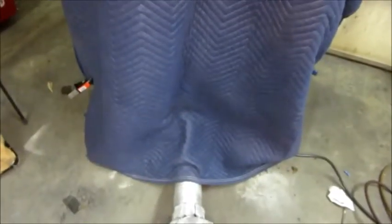The little heater's been blowing under the blanket to warm up the compressor, condenser coil, and all the lines. The vacuum pump's been running for about three hours, so I think we're good on moisture removal. Now I'm going to move on to the next phase of the repair and install a new dryer.